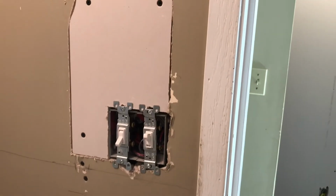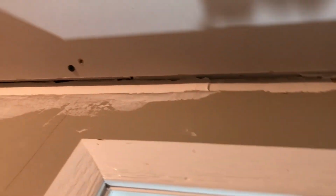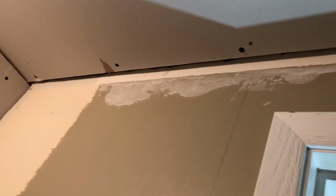So this is how I check the drywall joints, and every joint I give special treatment, like cut off the edges, fix the damaged corners. And you see that butt joint, the edge is rough and some area is damaged. So we got to V-cut this butt joint. Here is a big gap, more than 1/2 inch, right above the windows. So it needs some special care for this kind of joint. For this butt joint, the edge got to be cut off.